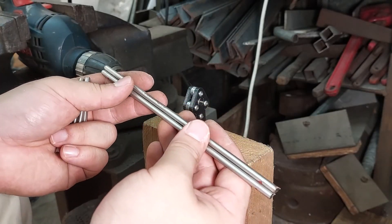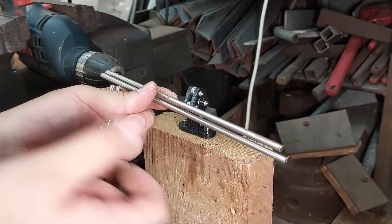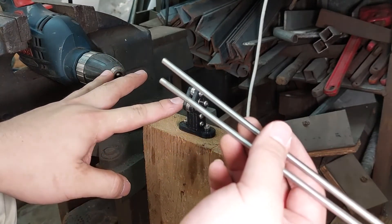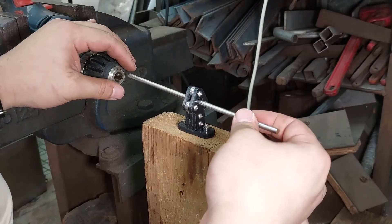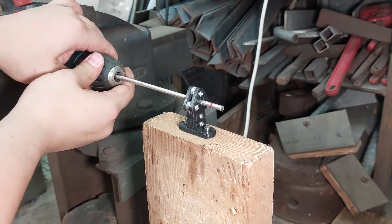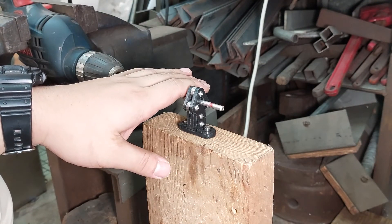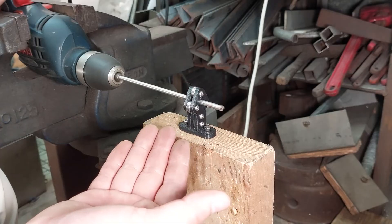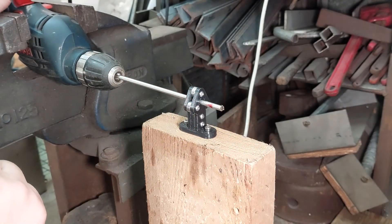I'm going to show how I set this up with the longer ones. It's relatively simple — I have it aligned roughly in-line. It doesn't have to be super exact since these are just metal links and not driveshaft components that need to run true. But this is already a lot better. There's still a little wobble at low speed, but once you spin it up to full speed the wobble goes away and you get really nice clean cuts.